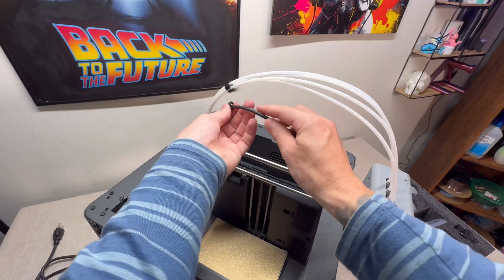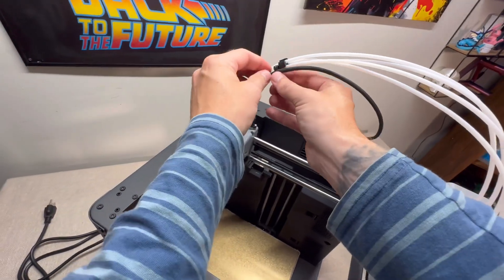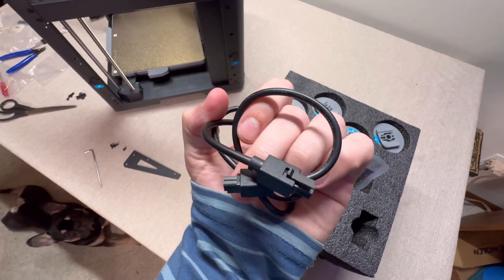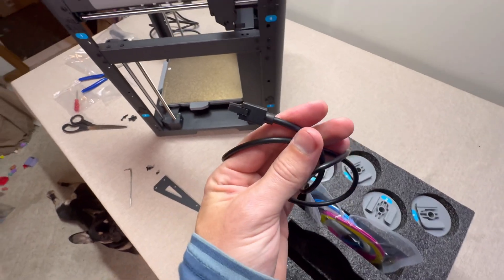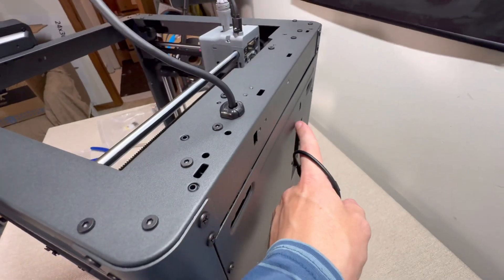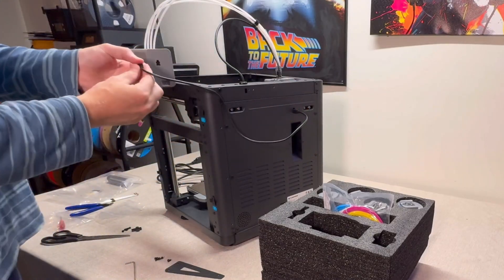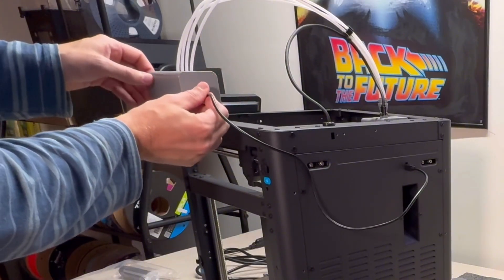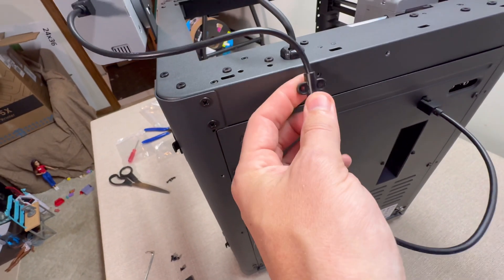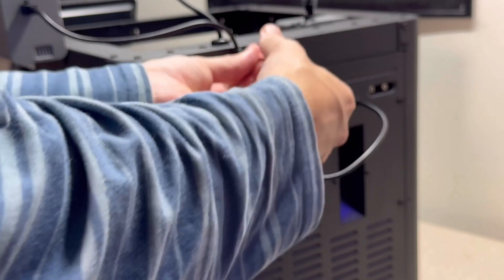There's a little bracket on this wire — connect it to the PTFE tube connector. Next, go back over to your accessories in the styrofoam and find this wire on the right-hand side. We're going to connect this into the AMS hub in the back — see where it clicks in? Then click it into the back of the 3D printer as well. Turn your 3D printer around if you need to get a good viewing spot, and click it into both locations. You should feel it snap shut and fall into place. This wire also comes with a connector that goes in the back of the 3D printer — find those screws and connect it in there. Use that Allen key to tighten those screws.